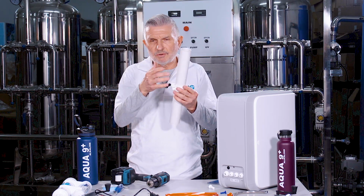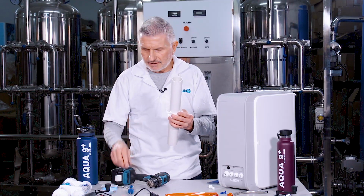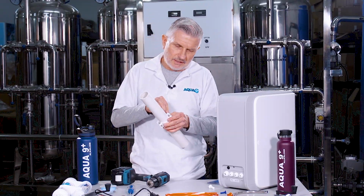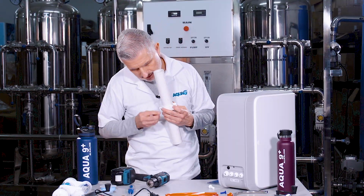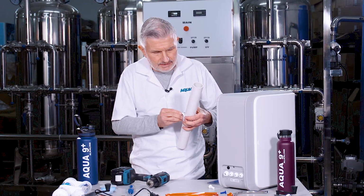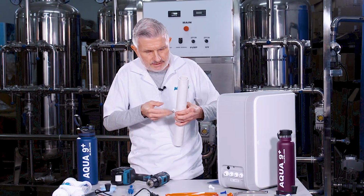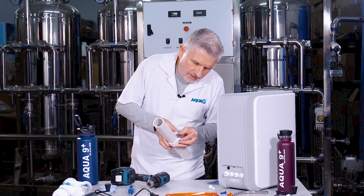And then take the other side of the drain clamp, hold it secure. Now, of course, you don't have to hold the drain pipe. I'm just holding it for demonstration purposes because you're going to be working with a stationary drain pipe. Go ahead and take each bolt and slide it through the slots like so. And let's do it one at a time. Take the nut and screw it on the bolt. Okay, got one side here. Do the same thing to the other side.